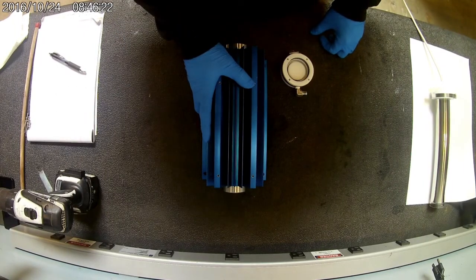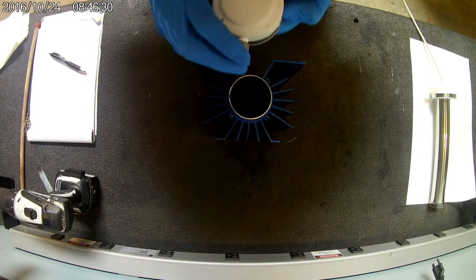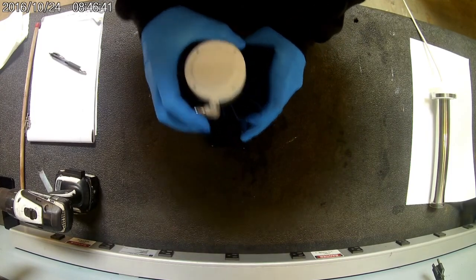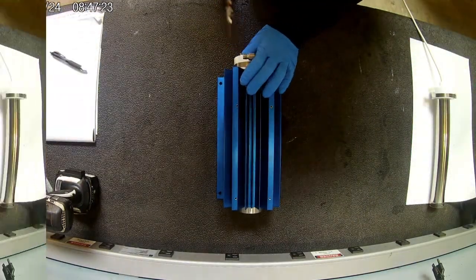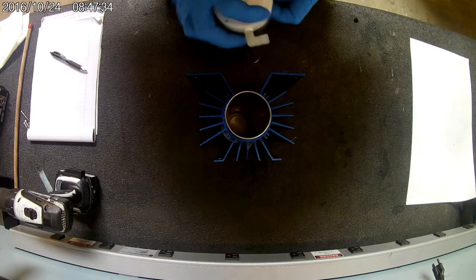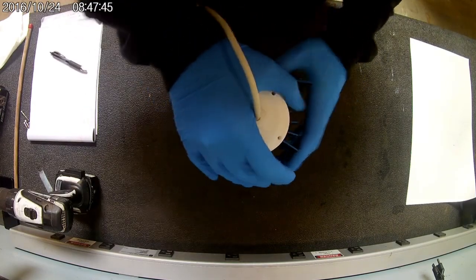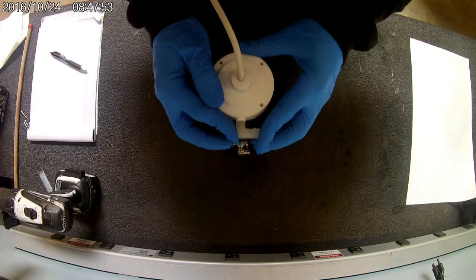Next thing you want to do, grab the chamber and the non-high voltage end cap. When you're installing these, you want to make sure you're putting downward pressure and not putting them on sideways and pinching O-rings. Alright, next thing, flip this guy up. And this one is even more important to not get crooked or twist. You want to put this glass in as straight as possible. You don't want to be twisting it or pushing on one side. You want to kind of evenly push on both sides. And again, you'll hear 2 clicks for that glass sliding over each O-ring.